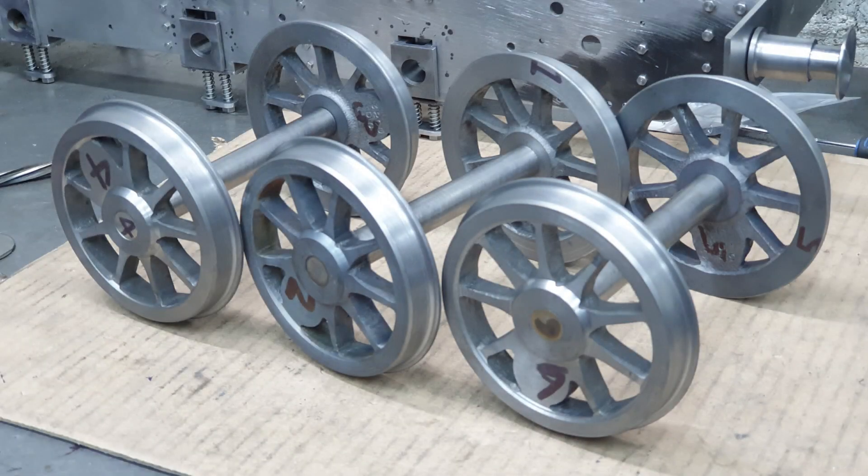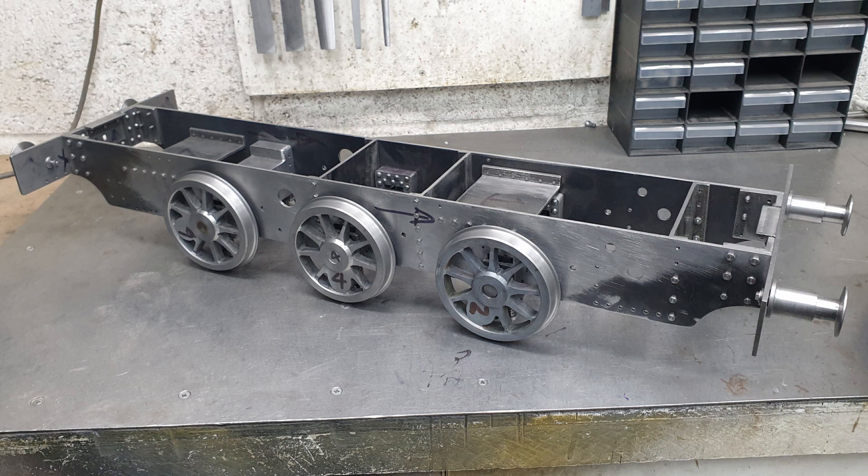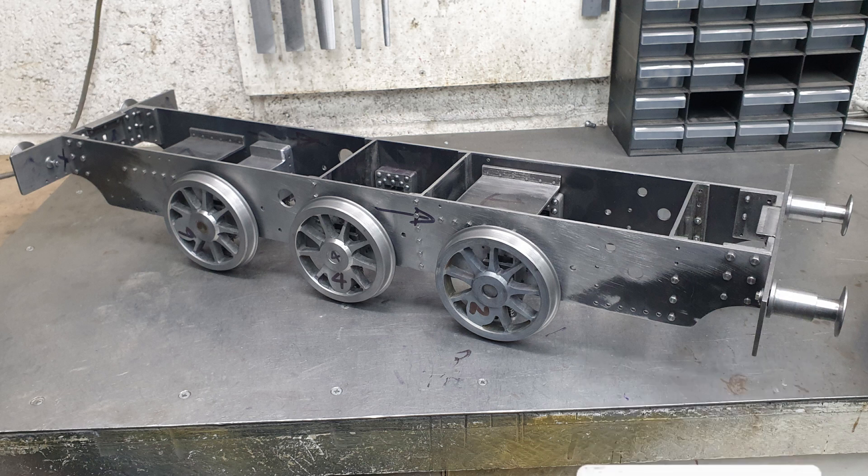The outcome of a lot of hard work is a set of 6 wheels and I am very pleased with the outcome. Cosmetically I think there's a bit more I can do — I can soften up the edges on those spokes and round them off a little bit with a file. Next I think I'll cover off the crank pins, both the turning of them but also the drilling and fitting of them to the wheels, and possibly securing the wheels to the axles with all the joys of having to quarter the wheels correctly. As always, thanks for watching.